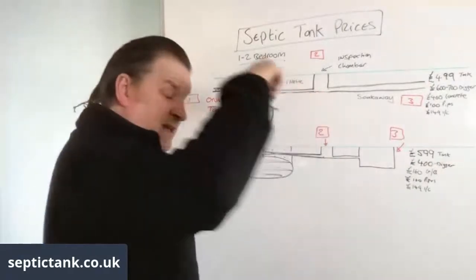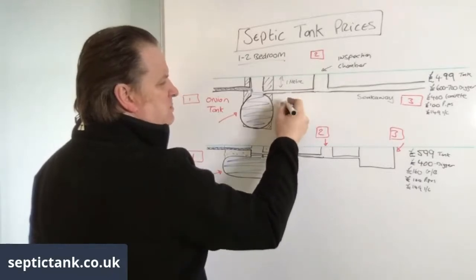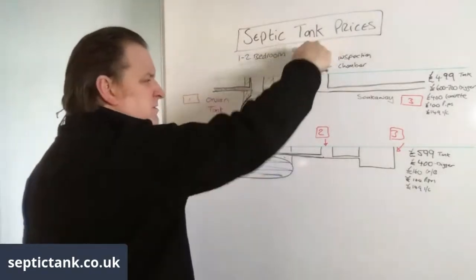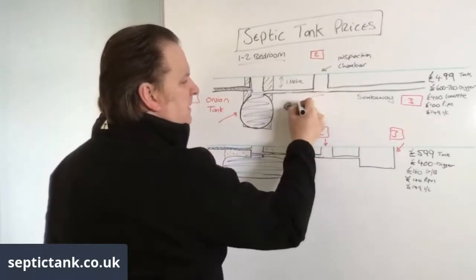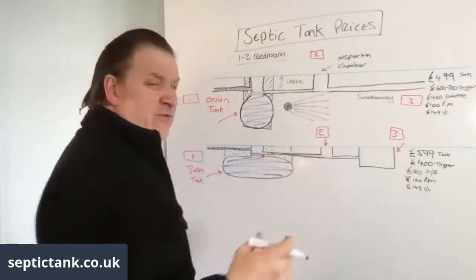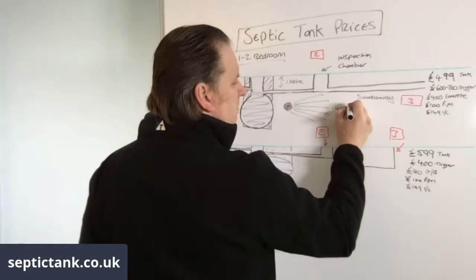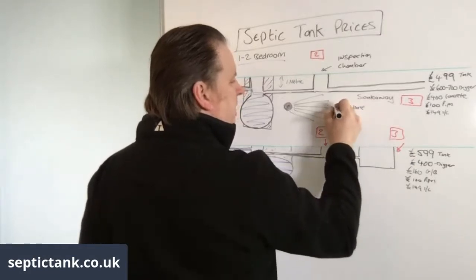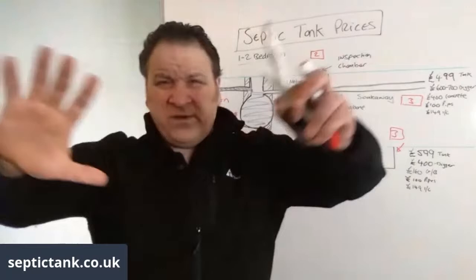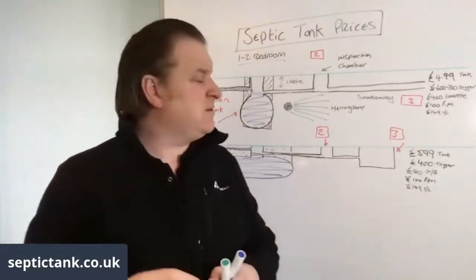So if I was looking at an aerial view, looking down, and this was the manhole chamber, this was the top here. That's the circular top. So that's me looking down onto there and looking at the soakaway. The soakaway would do something like this. It can be in a variety of shapes, and it's typically called a herringbone soakaway. Now, the deeper the soakaway goes into the soil, the more surface area you have to cover, because the deeper down you go, the more resistance you meet.